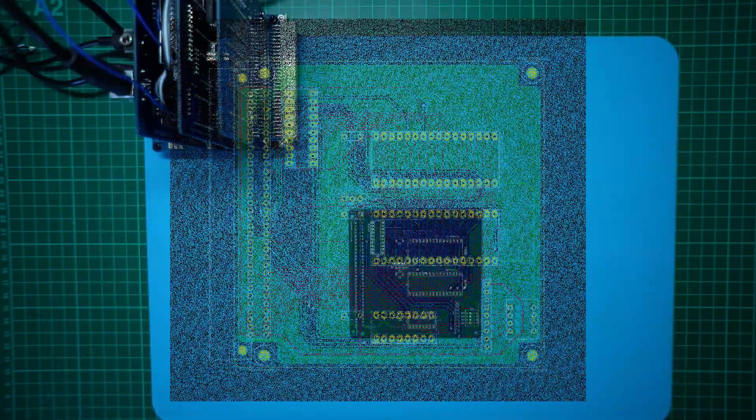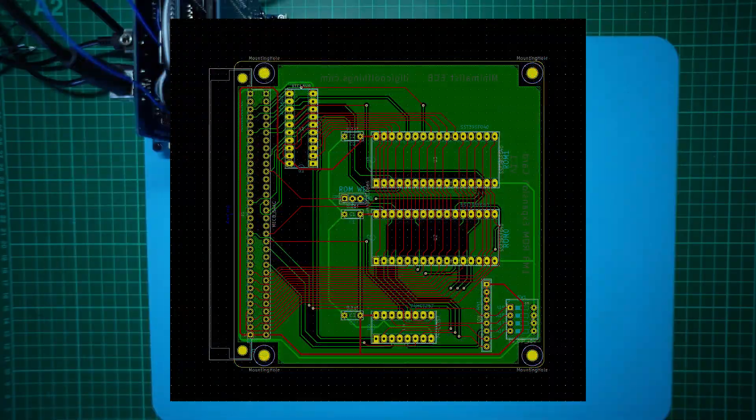So let's now have a look at the PCB layout. The PCB layout is pretty straightforward, again with the starting point being the MECB KiCAD template that I created earlier. Note that I've positioned the bank select switch at the top edge of the board for easy access. The silkscreen identifies ROM0 and ROM1 to easily differentiate the two 512KB ROM chips. The bank select switch footprint is a normal 4-way dual inline switch in a DIP8 package.